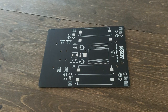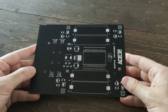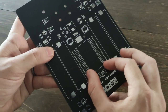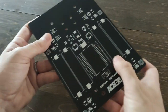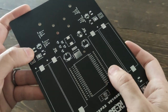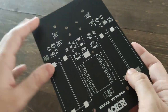Let's take a closer look at the circuit board. Here we have the circuit board for our ESP32 Voyager. These projects I feel like are never fully done, but at this point I'm really happy with the way this looks. There may be changes down the road and we'll be sure to update our board pages. I wanted to take a second to talk about all the features we built into this board and how you may be able to take it, change it, run with it, use this stuff to do whatever you want. I'm using the ESP32 with the external antenna — it's a little wider than some other ESP32 development boards, so just keep that in mind for the pin spacing. If you're taking this and want to use your own board, you may want to use a different footprint. Regardless, I wanted to include extra header pins that break out each of the GPIO pins, since the ESP32 has so many pins to work with. I also put a breadboard up front — the spacing is perfect for one of those mini breadboards so you can plug in tons of cool sensors and add a ton of features.